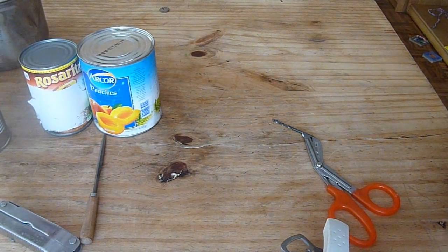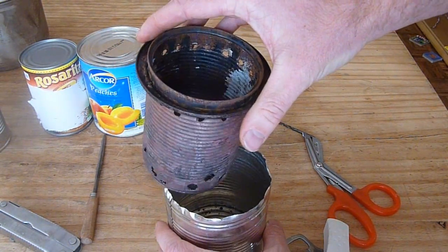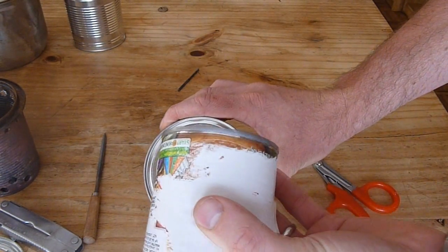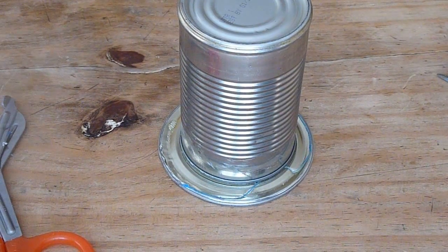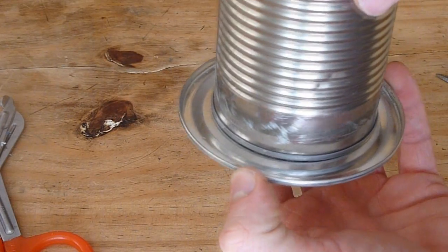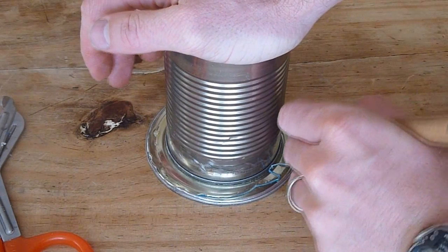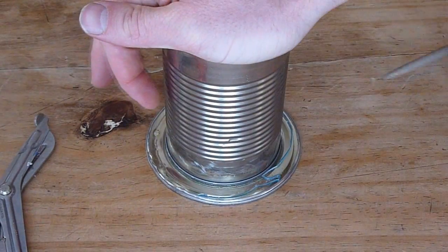Here's an example of what the finished stove looks like without the exterior drill holes, and inside you've got this other can. Now when you've got your lid detached, you're going to want to take the inner can and mark around the edge of it. The can doesn't fit exactly in one of the ridges from the top, but if you put the lid upside down, this can fits perfectly inside the rim. So score this mark around there — the better you score it, the easier it's going to be to use it as a guide.